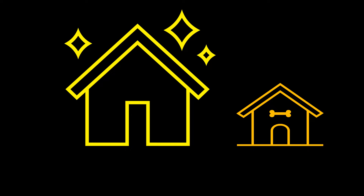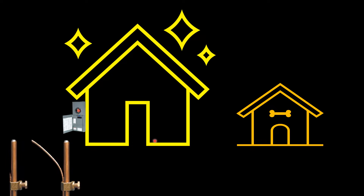This is what we're talking about here. Let's say that electrical has been good to me — this is an actual photo of my house right here. I have built me a man cave over here. We're going to call it a garage, call it a doghouse, call it whatever you want. Over here on my main structure when we built the home, we have our meter disconnect combo right here. We drove a ground rod here and, being good electricians, we drive our second ground rod six feet apart, connect them together, and run our copper wire to our meter disconnect combo. We are done for this structure.